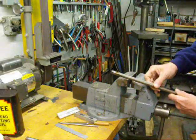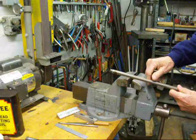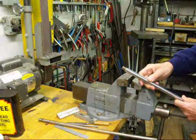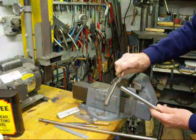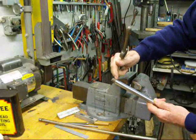There we've got a thread - that's not a very long thread, you'd probably go longer than that. Now if you are ever threading against a shoulder, for instance like this piece, reverse the die if you're using this type of die stock. Reverse it and that will get you a deeper thread closer to the shoulder.